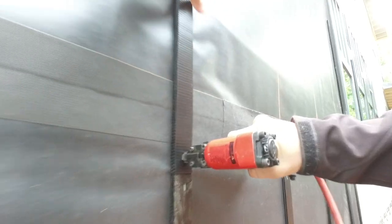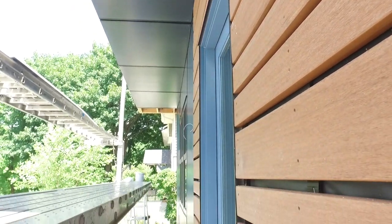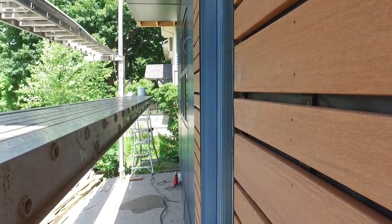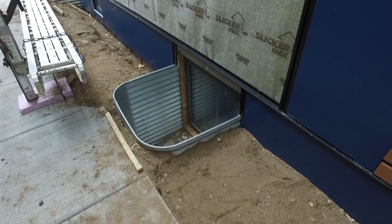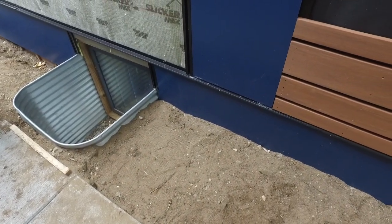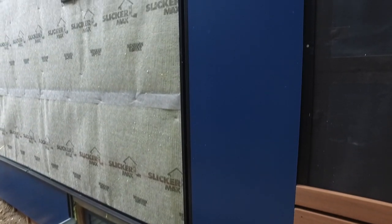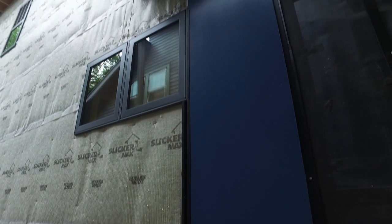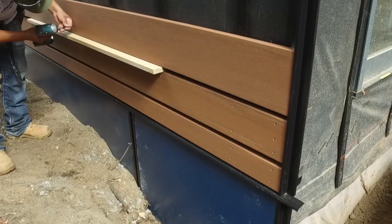The battens are stapled to the house and now we're ready to do some open joint cladding. The cladding systems are separate but intertwined to some extent. The edges of the Paint Pro panels are trimmed with architectural metal profiles from Tamlin, so a lot of the cladding layout is done when those profiles go up. The crew lays out the Tamlin trim profiles to align with windows and other architectural elements. The profiles overlap the Paint Pro panel edges to allow for movement, while the edges of the open cladding system just butt the termination strips.